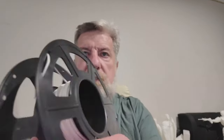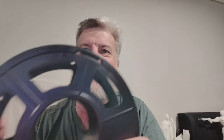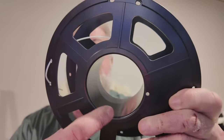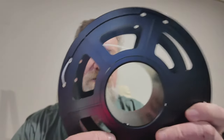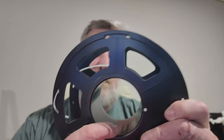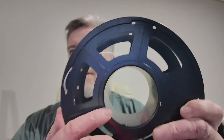You can see on this spool I've got a small spool of filament. See how that little bit of plastic filament is sticking out the end there, just on the inside? What happens during manufacturing is they stick it through the hole and wrap it around, and it bends the filament there. Every now and again that gets caught and the printer doesn't know it's running out of filament, because the end hasn't gone through the filament runout sensor, so it thinks it's still pumping out filament when it's not.